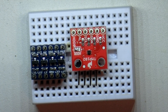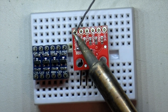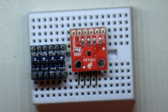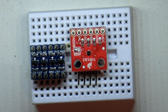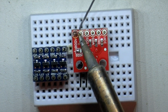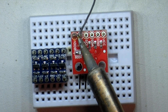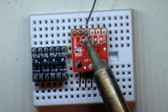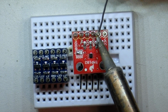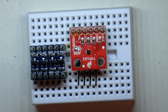So with that, take the soldering iron and clean the tip so it's nice and shiny. Touch it down where you want to apply the solder, and then wait for the soldering iron to get hot — that would be a good thing. There we go. Touch it down and then when the pin is hot, just apply a touch of solder directly to the pin and it will melt right on. The pins are designed so that just about anybody can solder them without much trouble. A little bit of solder goes a long way.